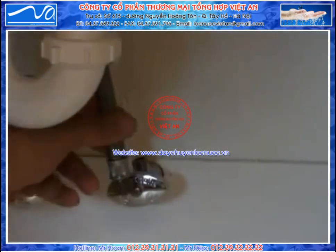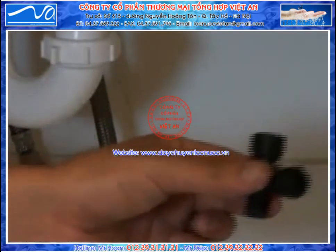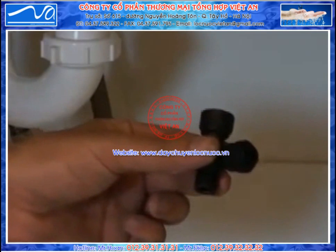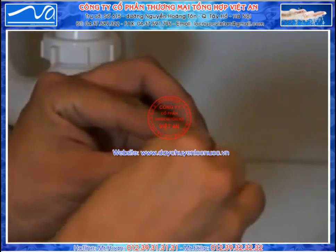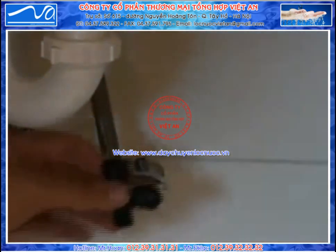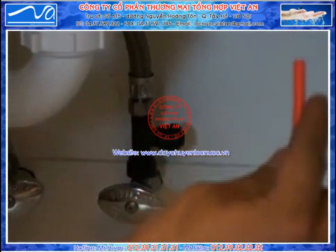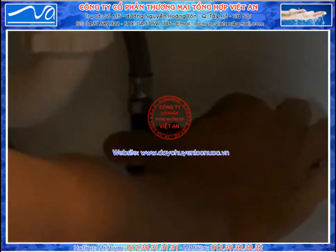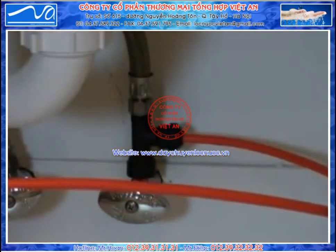Go ahead and unscrew the hose and locate your EZ Faucet Connector. This is the black piece we're going to use to attach your RO system to the water supply. You also need to find the white washer. Go ahead and insert it into the top and then screw on to your water supply. Once you're finished, it should look something like this, and you can take the red water supply hose and simply push connect it in. Your drinking water system now has a permanent connection to your home's water supply.